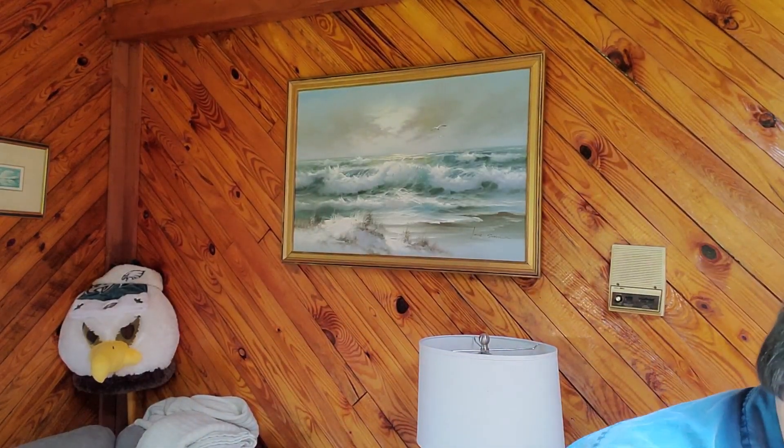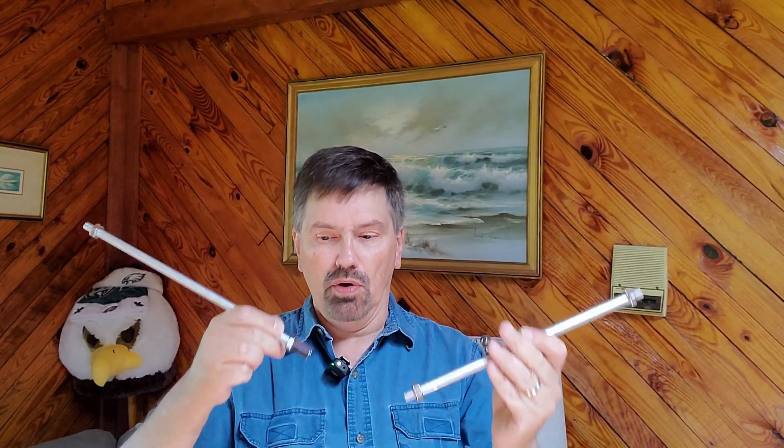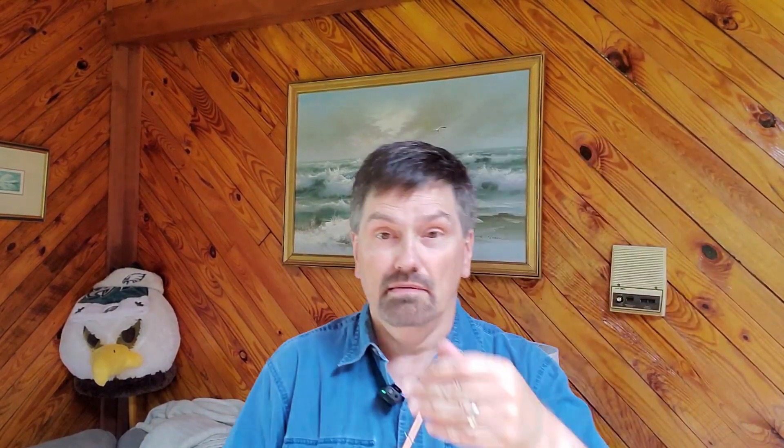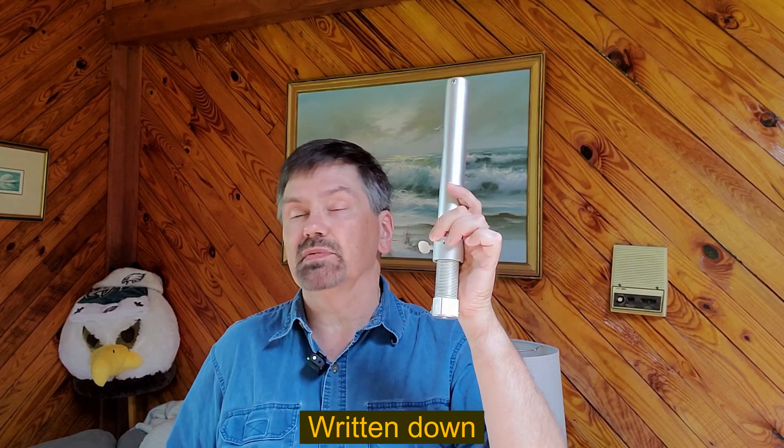The antenna consists of a tripod base, the actual coil to adjust it — similar in concept to the screwdriver antenna — an add-on coil to bring operation down to 80 meters, two risers that when screwed together will lift the coil about three feet off the ground, a three-and-a-half-foot telescoping whip, and a flat plate along with a C-clamp in case I want to mount this to a table. I added a 90-degree PL259 to make hooking up the coax a little bit easier, and a tape measure where I measure from the bottom of the antenna to the bottom of the sliding tube to set the amount of coil to expose for the various bands.